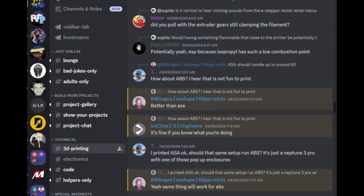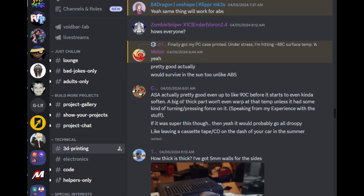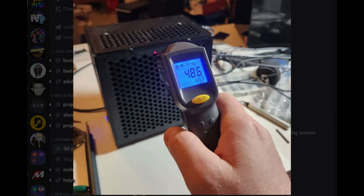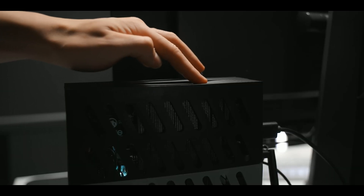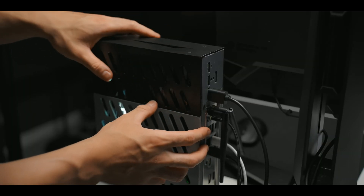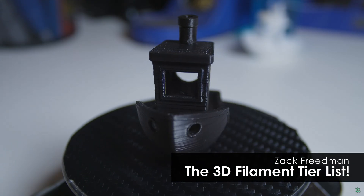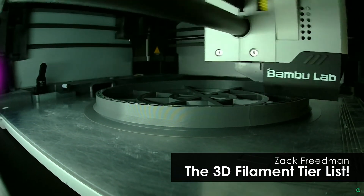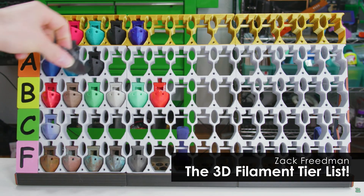With an improved design and intending to make this build last, I'm printing this with ASA filament to handle the high temperatures radiating from the machine. With the parts I've selected, I took some initial stress test measurements with temperature and posted those over to the Voidstar Labs Discord. According to the guys over there, they confirmed that ASA was in fact the right choice — PETG might be in that danger zone where we could see some warping. If you'd like to see me talk more about 3D printing and case designs, let me know down in the comments.